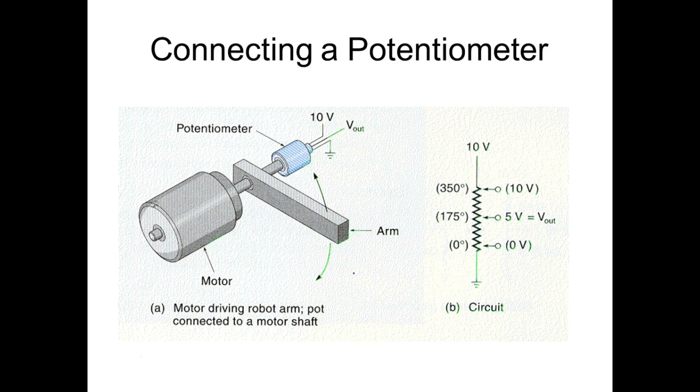So a motor, we say it has an unlimited stroke, but somehow inside that car door, we have to limit that stroke, right? We have to make the motor turn long enough to unlock it and then stop, because we don't like stalling electric motors, because they'll burn up. And when you unlock the door, we have to have something that limits the stroke both ways. So here we have an example of a rotary pot. The problem with a rotary pot is that we have one of two options. We're going to have a limited stroke on the rotary pot, or it's just going to spin and repeat itself, right? You understand?